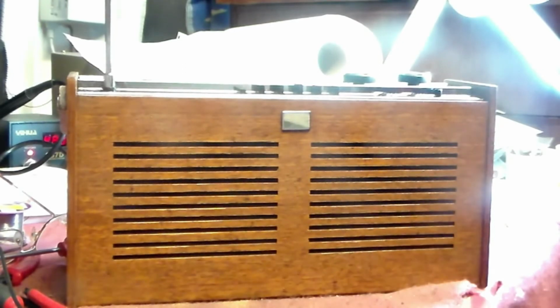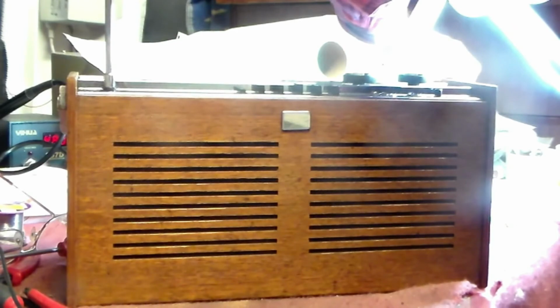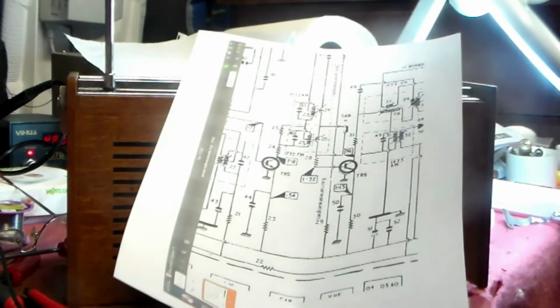The IF stages on this, by the way, have all been replaced. The first IF stage was replaced by a bridging transistor. The second one just had the AF117 zapped, and the third one was replaced by a BF450, which is a silicon transistor. Now the main difference between silicon and germanium transistors is the base voltage. If you look at that, you see, we can see that.